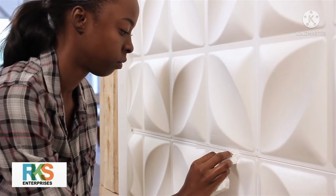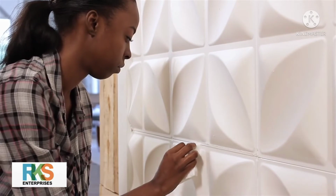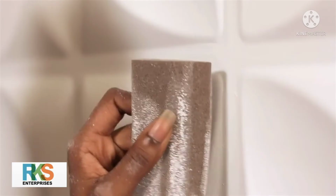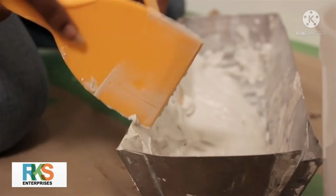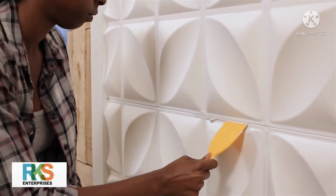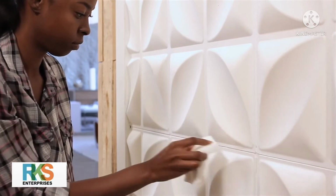If you need a quick knockdown sanding to smooth the joints out, do it between coats. Do not oversand. The second coat should be for creating a smooth transition between the tiles. A final sanding will be required to perfect the blending. If you need to go back and address certain areas with additional compound and sanding, now is the time. Wipe clean with a damp rag or vacuum.